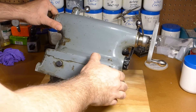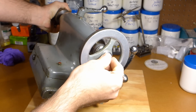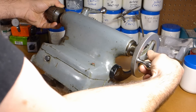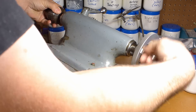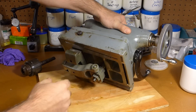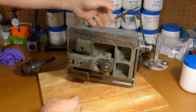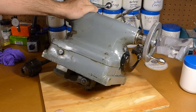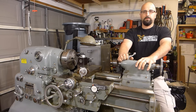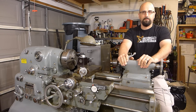I know I really didn't cover how this comes apart, but it's pretty simple. There's a little plate here — you've got to build your little spanner if you don't have one, or you can stick a couple of Allen wrenches in there and pry on it with a screwdriver. That right there pops out. Basically there's a big Acme lead screw going through here that screws into the quill, and then they unscrew — just like that. And that's also how baby lathes are made. These two have split apart if you need to take it that far. It's all cap head screws, a few pins and stuff you've got to knock out. Kind of a pain, but you can do it in an afternoon. Sorry I didn't have a detailed disassembly on this — I actually did it well over a year ago back when I was a tech and just had a slow day at the shop. This was before I even planned on filming this whole series.